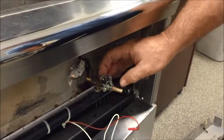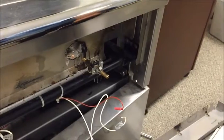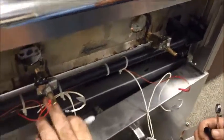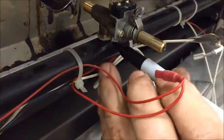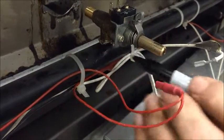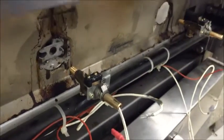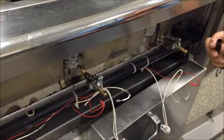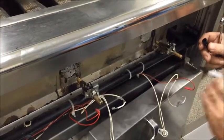If you have a little felt pen, you can use it for the next valve. Go in and clear away your pipe dope, then take a black felt pen and put a little black mark right on that one thread — just twist it so you can see the black felt mark there. When you get the new valve, hold them next to each other and transfer the mark from the old valve to the new one. When you screw it in, go all the way down until you get to that black mark, so you don't have to guess where the height is.